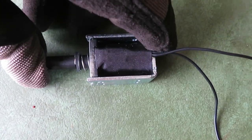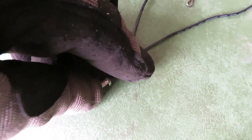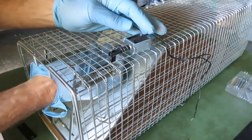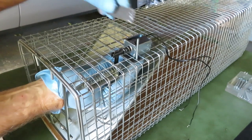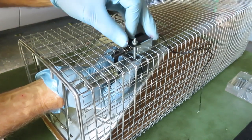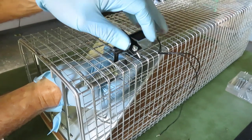Our solenoid is going to be first, followed by our push-button switch, which is in here to cut power to the solenoid when the door opens up. We're going to mount the solenoid with this bracket — I made these up, this little clamping device, just out of some sheet metal, cut with shears and drilled a couple holes. I couldn't find anything pre-made that would fit. I did the same for the lever on the left, which is on the solenoid spindle — also just a strip of sheet metal cut to size and drilled.